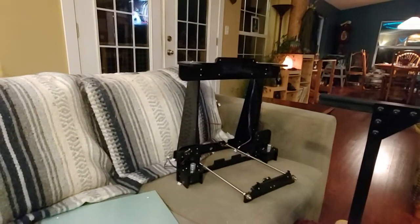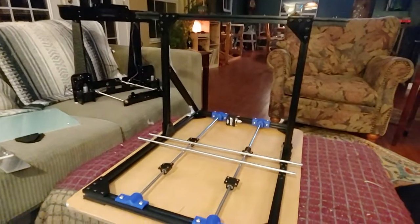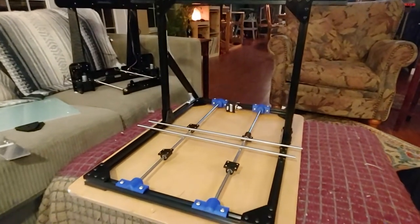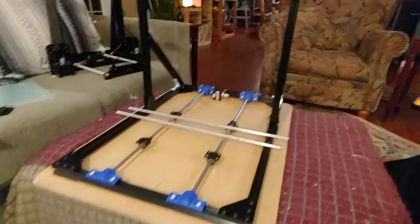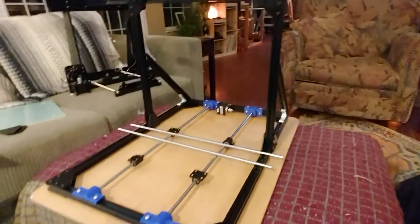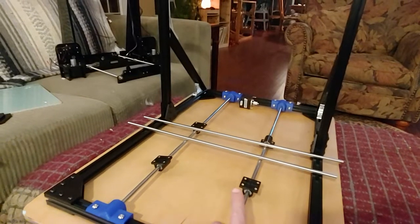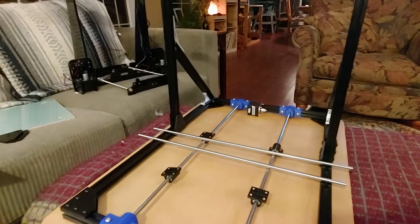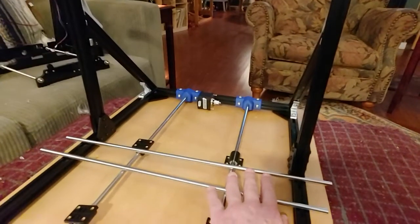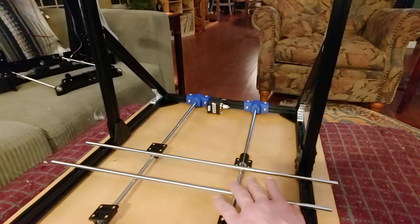They're pretty basic geometry, so I started picking away at it and looking at parts on Amazon, and it just really doesn't cost much more to scale it up. So I've got an aluminum frame going just out of 2020 extruded aluminum. I've upsized these — these are 600 millimeter, really easy to get, don't even need to cut them. These are, I think, 500 millimeter. Again, really easy to order on Amazon, just don't even need to cut to length.